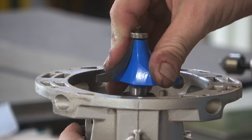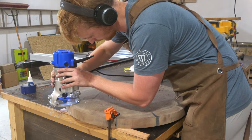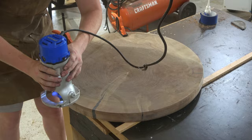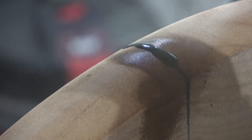Going back to the tabletop — I wanted to add one of my favorite edge profiles to this table, and for that I needed a bigger router bit. This is a one-inch round over bit, and I found out pretty quickly it's pretty sharp since I accidentally cut my finger on it before I even got it in the router. With a bit this big it's important to take it slow and do multiple passes. My goal is to not use the full depth, which will give the edge a round over but leave a sharp edge on the top — I call this profile 'pillowing' but I think 'fingernail profile' describes it better. If you look at your thumbnail, that's pretty much the profile I'm going for.